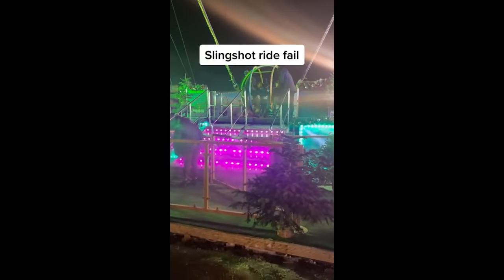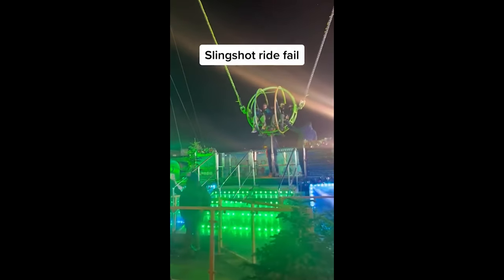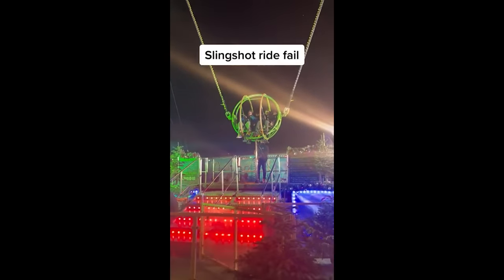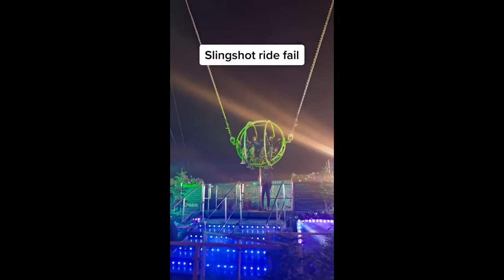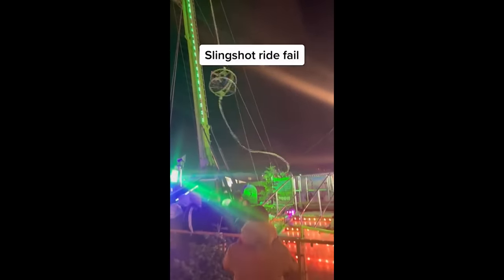On Wednesday, December 14, 2022, at Hyde Park Winter Wonderland, a showman-owned and manufactured elastic slingshot was operating normally. Around 8:20pm, the ride was loaded with two riders and it began to tension its bands for launch. The winch on the right side of the ride tensioned as normal, but the winch on the left side did not tension the elastic bands at all due to a mechanical issue. This caused the rider capsule to slip off the electromagnet and fly into the right side tower.